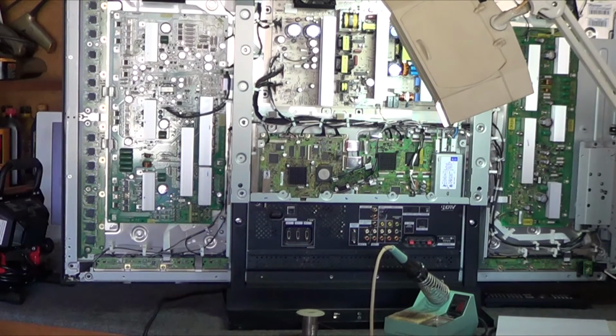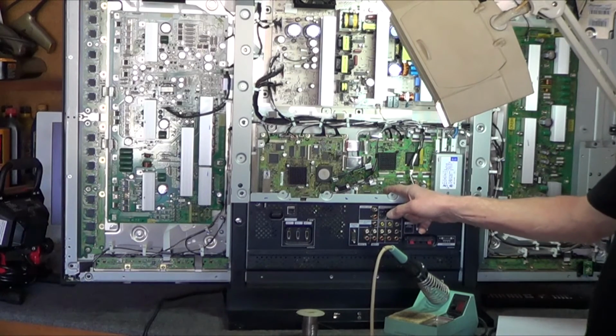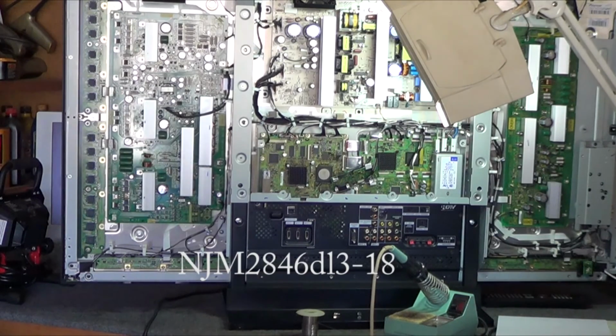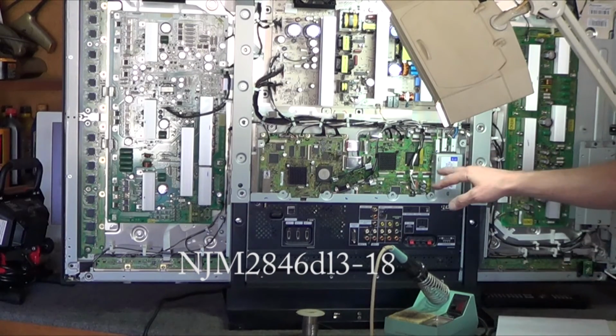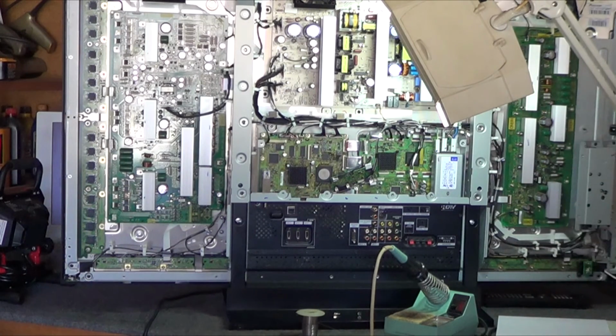The regulator itself, you'll see if you get the service manual, you can look up the actual part number because it's not what's written here on the silk screen. The part, you can see it's on eBay. It's $29, $30 for this little kit of various parts, and it probably contains this regulator. I'm sure it doesn't really describe what the parts are. It just says 8 blue blink light fix-it kit. You can go to DigiKey if you have the real part number, search for it, and it'll be there, and it's a whole $1.17. I've ordered it, and I'm waiting for it.